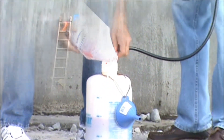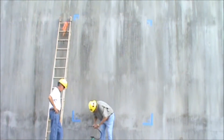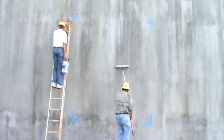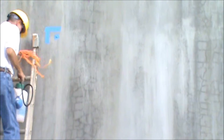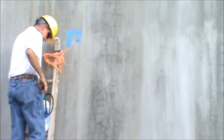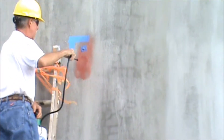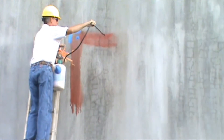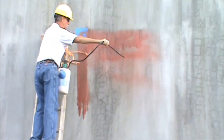This will allow quality control personnel the ability to look at the exterior of a tank or any concrete surface and know that the product has been applied. By the depth of the red tint, we can tell that the product has been applied in sufficient quantities and has been allowed to absorb into the shotcrete material.